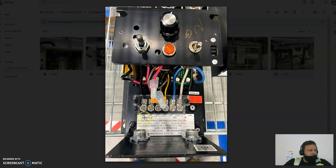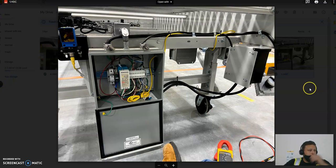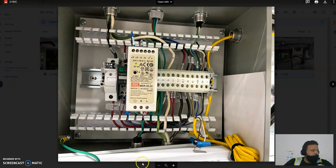The DC output comes back into our control box as a plus and a minus. Your A-plus and A-minus go through the terminal block and feed through the middle up here. Now, back to the other line — the other L1 that looped around to the bottom of this 24-volt DC adapter. That's basically where it ends, and then at the top you have your plus-24 line and your zero-volt line.